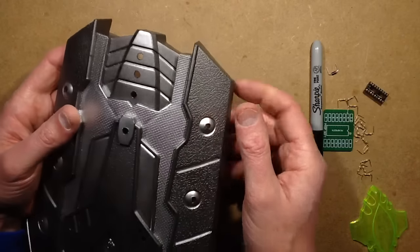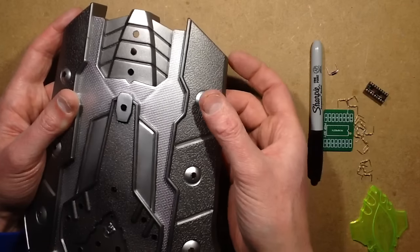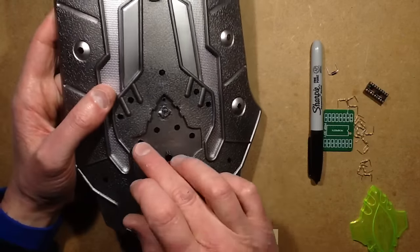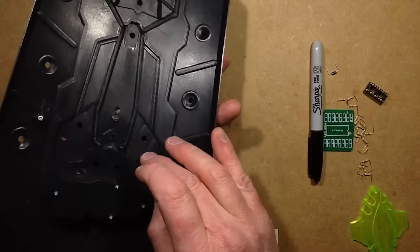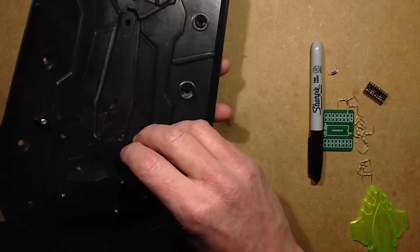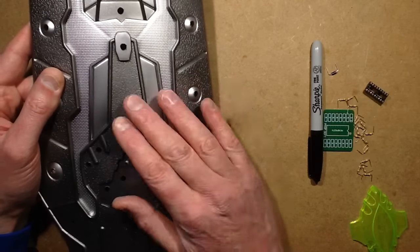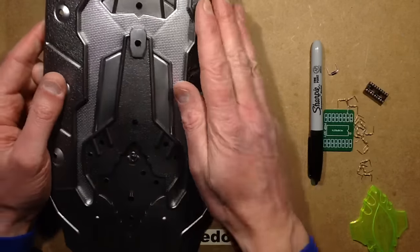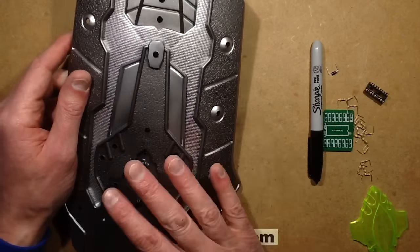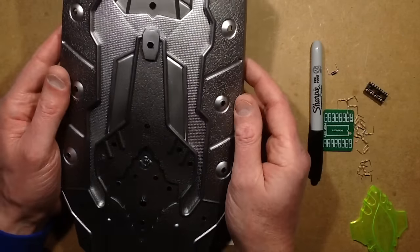When you drill, you're better doing a pre-drill with pilot holes and then gradually moving up. Also experiment on the material you're going to be drilling, because the last thing you want is to find that the drill snatches in and bites into the plastic — that can just rag the edge and it can look bad. Practice first, even if you've got a spare bit of material. It helps so that when you work on the actual prop you don't make a mess of it.